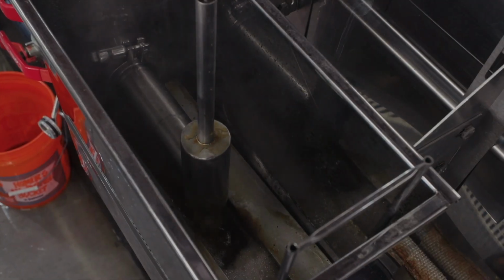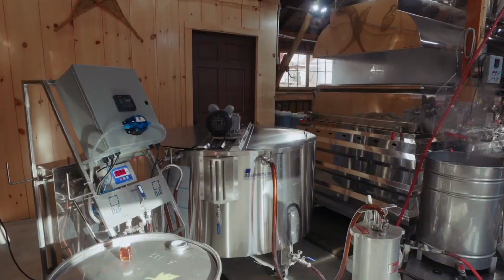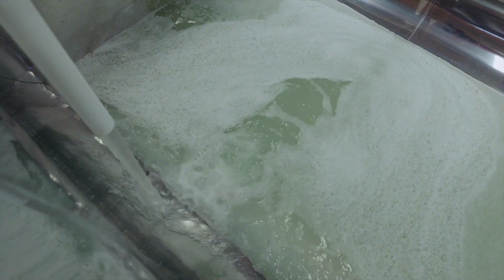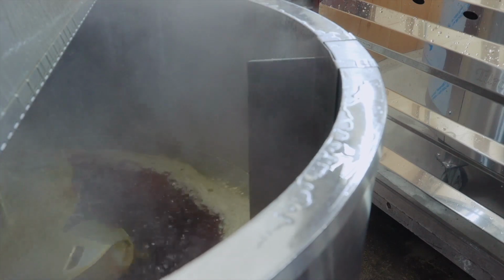So the great benefit of reverse osmosis is that we can really reduce our energy consumption for turning sap into syrup. So for example, going into reverse osmosis, we'll have about 40 gallons, this barrel full of maple sap, that's only 2% sugar. Coming out of the reverse osmosis, we'll have 4 gallons of concentrated sugar that's around 18% sugar.